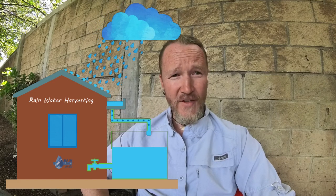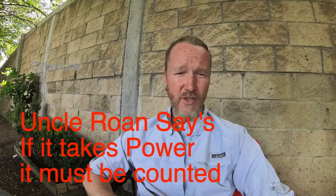If we use a water analogy, which is useful a lot of times in electricity: you've got water coming in, and that's like your solar. You've got a tank of water, and that is like your batteries. And then you've got essentially a hose that comes off of that — that's what's called your load. So this is going to be lighting, convenience outlets, your fridge, heat, cooktops — anything that draws electricity.